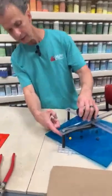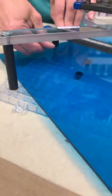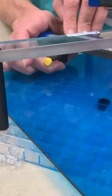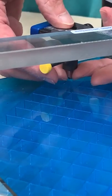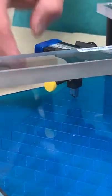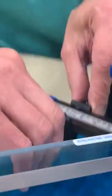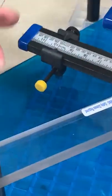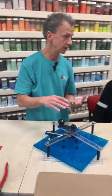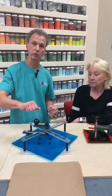The cutting head is here — it might be hard to see. The recommendation is: if you loosen the little yellow knob, the cutter head will contact the glass. You want the cutting head just resting on the glass, then tighten it to hold it in place. You can adjust it for different thicknesses of glass. Ideally it'll be at the right height so you don't have to apply a ton of pressure to get the score.